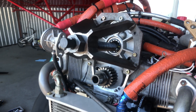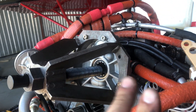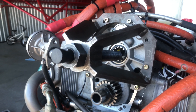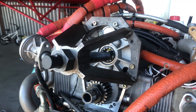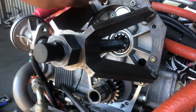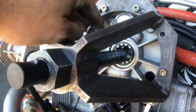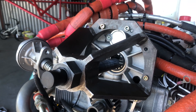We've cleaned off our crankcase housing — we wanted to make sure that was nice and clean so our jig sits flush against the case. To clean it off we used a little scotch-brite, a little elbow grease, then cleaned it with some alcohol. We'll do one final alcohol wipe-down before we put the final sealant on. Also, do this step first because the scotch-brite will create contamination inside the gearbox area as you scrub away the old sealant — you don't want that falling down onto the new seal or bearing.